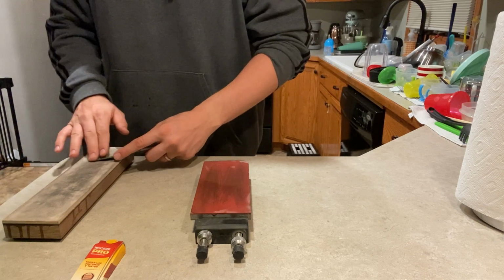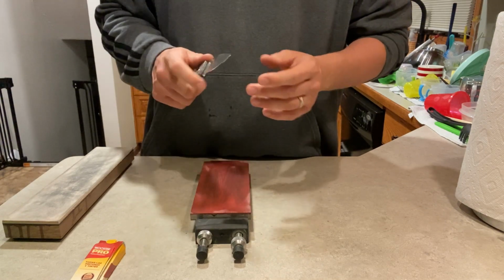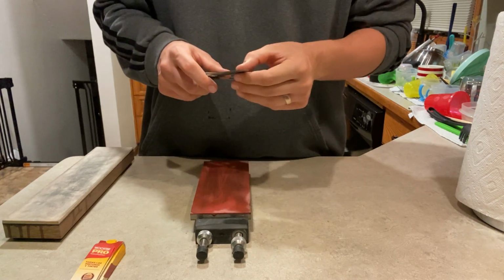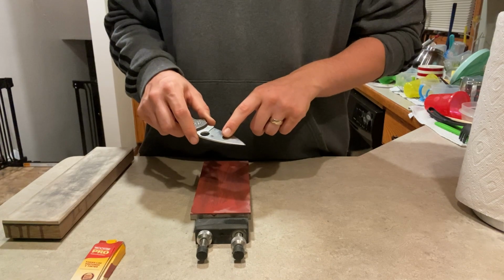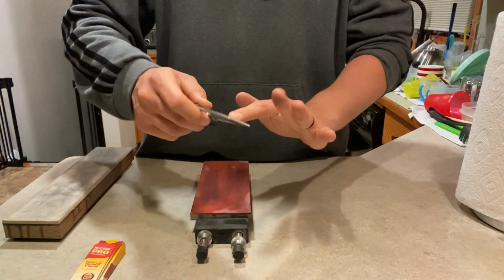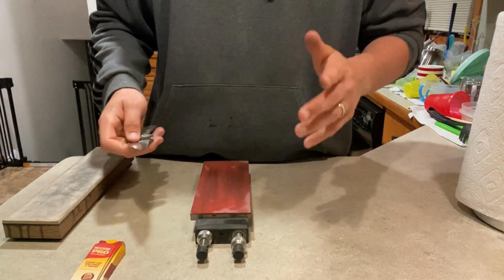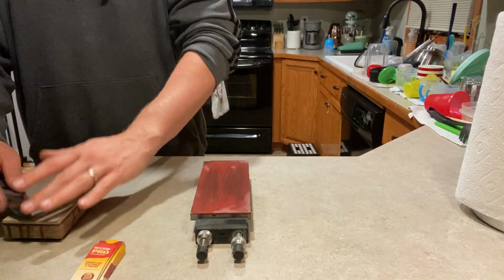But yeah, best thing to do though would be to go down to a much lower grit and reform that apex. I've got a whole bunch of convexing going on. And that's just overall, especially right down at the apex, gonna make your apex not very sharp at all, and kind of fat, not wanting to cut very well. And when your bevel is all convexed like that, it's really hard to hit it evenly, because you're relying on a consistency in a rocking motion to get that same convex every time, and you're not going to, so your apex ends up being super inconsistent. It's really hard to deburr because how do I know I hit the whole edge? So yeah, not ideal.